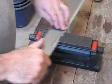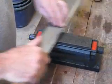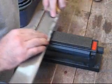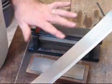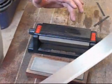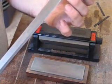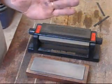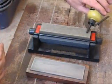I give myself a nice polished edge, and this I will actually use to take down to the edge — it's the first time I've actually worked the edge on any of these different stones or file or whatever. Once I have the steel removed with the coarse stone the way I want it, I'll use a combination of the diamond stone and a medium Arkansas to put the final polish on the edge. Once I can feel it's developing a wire edge along the length of the blade — where the edge of the steel is beginning to fold over at the very tip — I'll turn it and go to my fine Arkansas for a final polish.